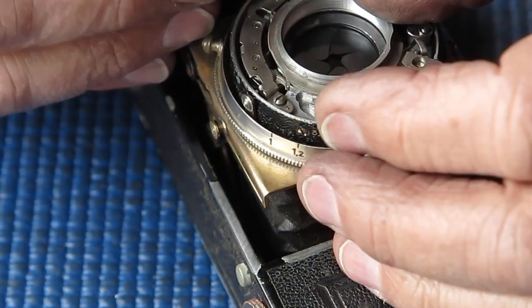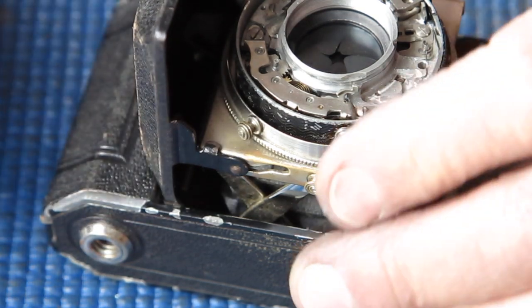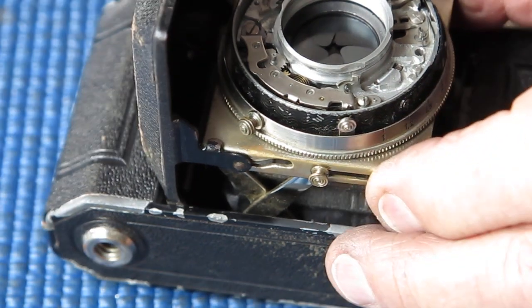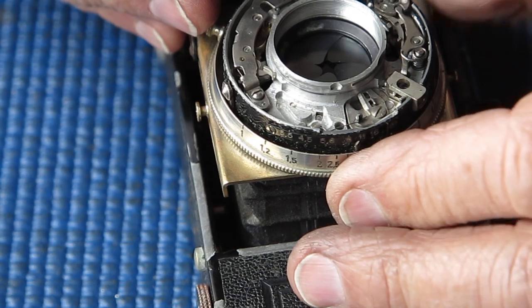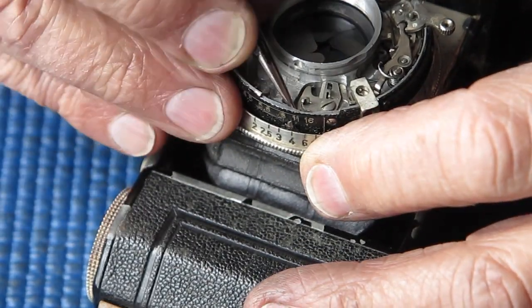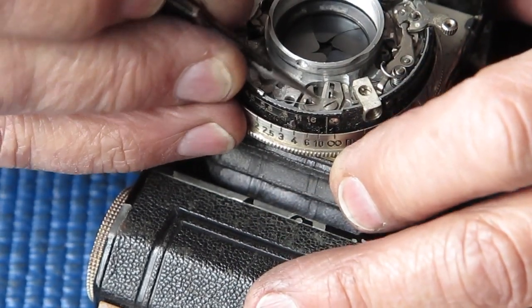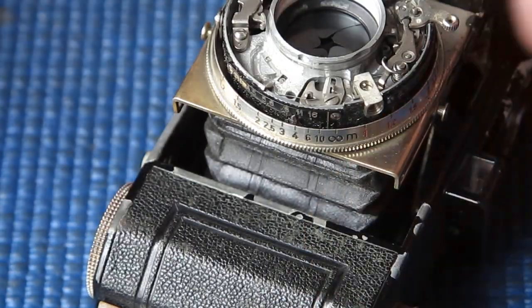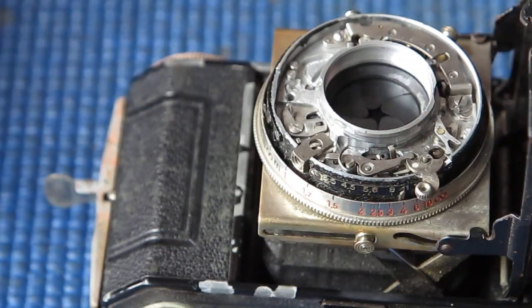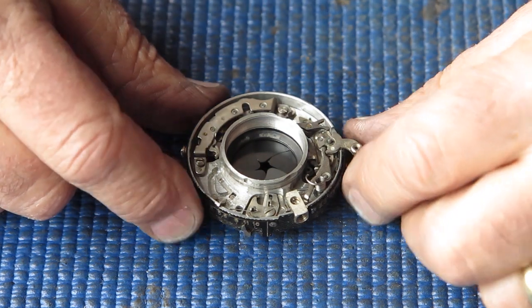It's not very well done. I'll hook the main spring and remove the main lever. The blade actuating ring doesn't appear to move at all. That's a properly buggered shutter — I'll have to get that out and get it to bits. We'll start with the shutter. Right, the shutter's out.